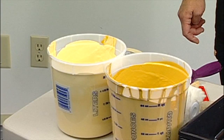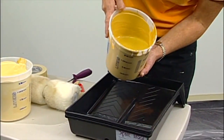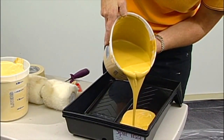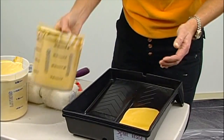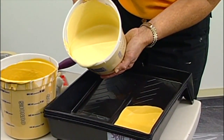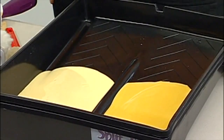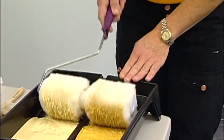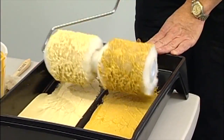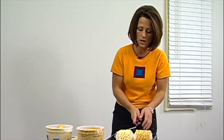We need to take our paint and put it into our split tray, putting one paint on one side and the other paint color on the other side. This is regular satin finish paint. There's our first color, and we'll take the second contrasting color and pour that in on the other side. Then take the two-color roller and get the tips wet with the paint, rolling back and forth. You don't want it totally saturated — just the tips — rotating it so the paint is evenly distributed all the way around before you paint on the wall.